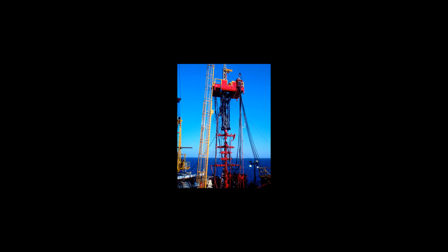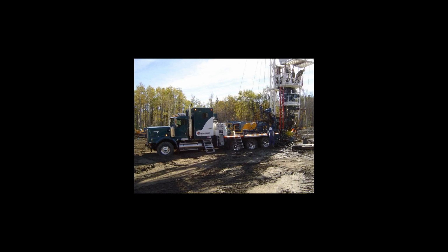The first stage of lowering a collar through the stripping system is to close the lower rams so as to seal off the mechanism above from well bore pressure. The space between the rams can then be bled off, allowing the upper rams to be opened. The collar can then pass through the opened upper rams.